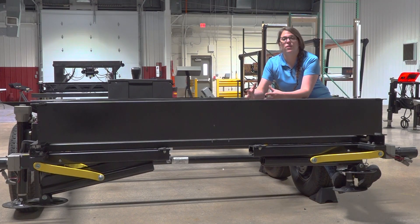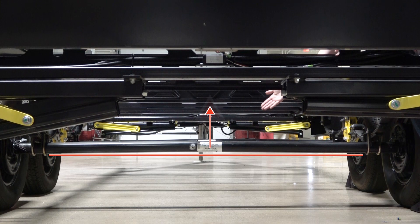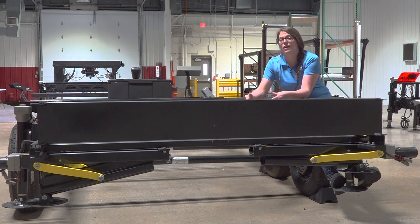Another detail that will help you identify if your axles have been installed in the right orientation is the camber of the axle tube. The axle tube should be installed with positive camber. Camber's definition is to arc slightly, and when it has positive camber it should be arced up. This will help angle the top segment of the wheel assembly out, which helps when your camper is carrying a load and will help distribute that weight and allow for slight adjustment of all of the components for your suspension system.